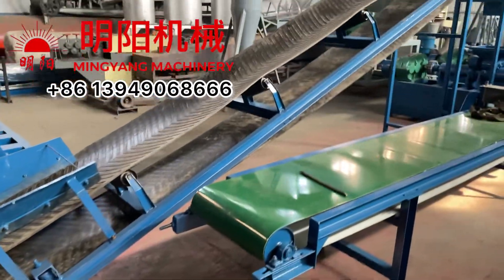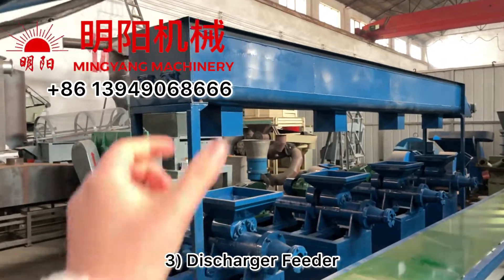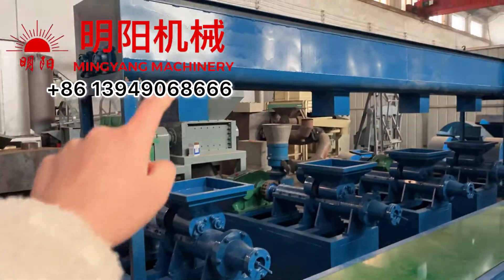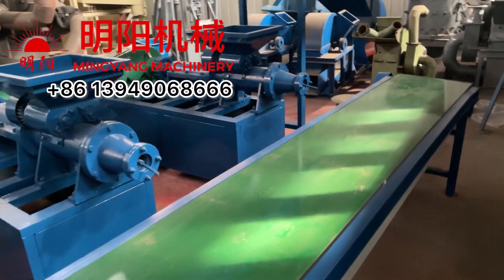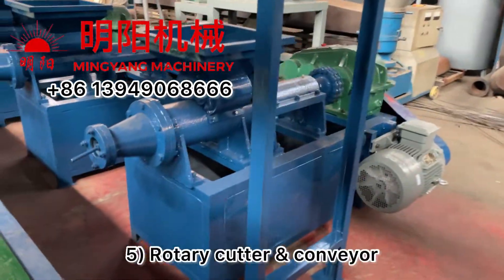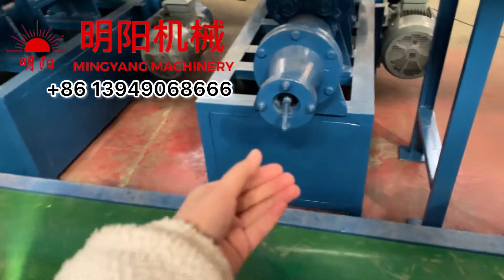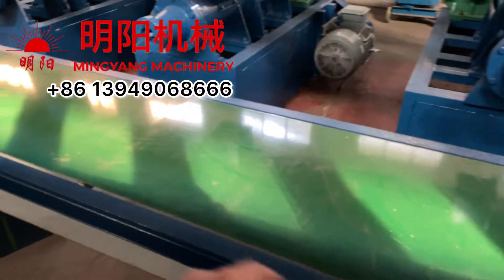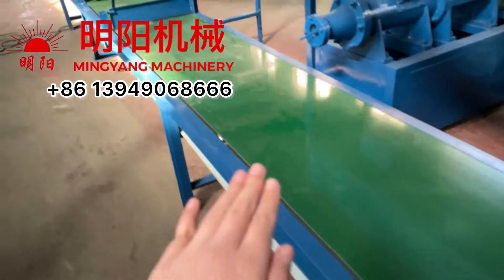After this, we transport the ready mixture to the discharger. There are double screws rotating, working with our design. Underneath the feeder, there's a full extruder, and it uses molding made by alloy. Our worker stands here, getting out the charcoal in long sticks. The conveyor transports the ready long-stick charcoal to the automatic cutter.